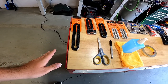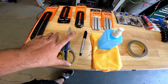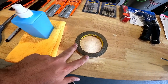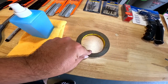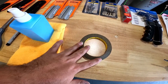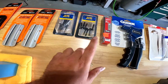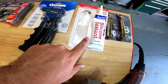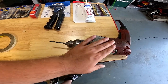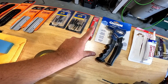In order to do this job correctly, you're going to need your mount or mounts of choice, a pair of scissors or clippers, a fine tip Sharpie, a microfiber cloth, and some isopropyl alcohol, some double-sided tape. I prefer electronics repair tape, but any thin double-sided tape will do the job — just don't get that thick stuff at Walmart. We just want something that's going to temporarily hold our mount. You're going to need some marine grade waterproof pop rivets, a rivet gun, some marine grade silicone sealant, and a drill with a 3/16ths drill bit. Make sure you're using a good new drill bit with a nice sharp tip on it.